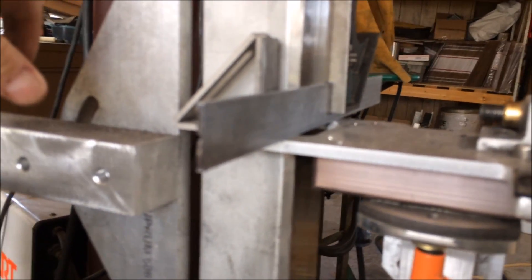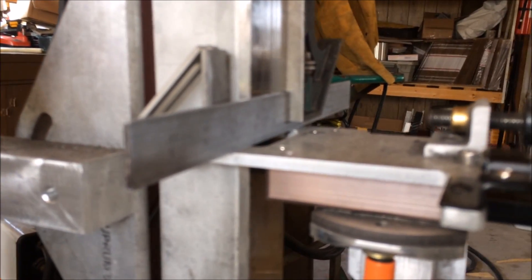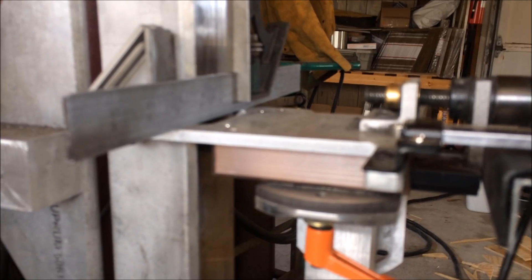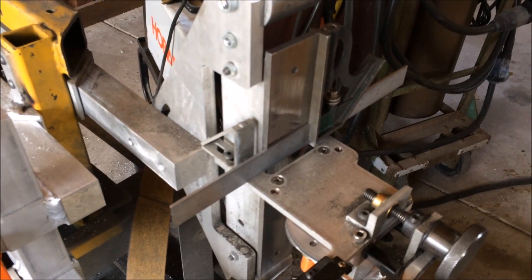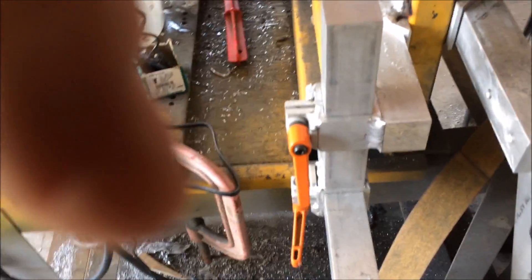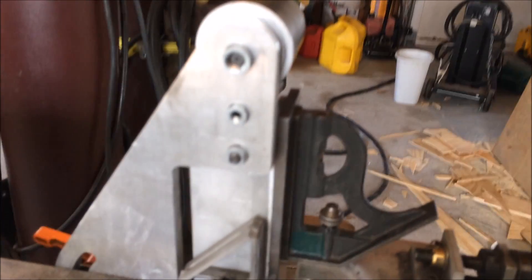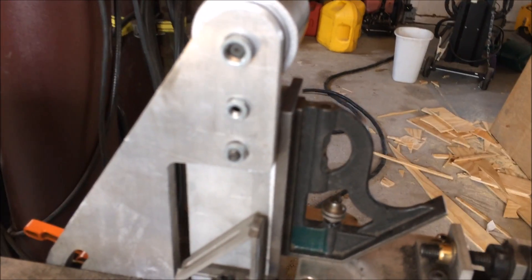This all depends on the side of your platen being flat or square, so you need to take those things into consideration. That's the first thing I do — square it in that direction. Next, I squared it in this direction so that I know where 90 degrees is.